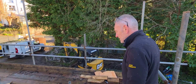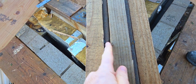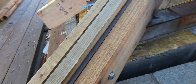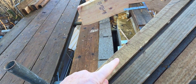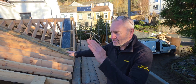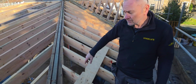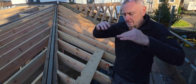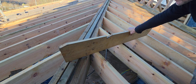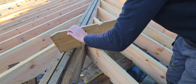As you can see, this is our triple hip with the steels in the middle. You can see the steel there and the steel there — it's all bolted and welded in place. If I show you a profile from the side, you can see this one stands up higher than this one, and that one is at a different level. This side of the roof is a different pitch to that side, and different to that side again. For the roofer to get his batten to go all the way around without any discrepancy in levels, this had to be lower, so when the rafters and battens go on they run with no gaps underneath.